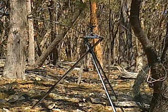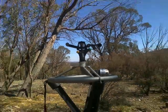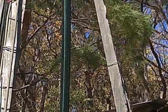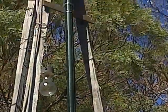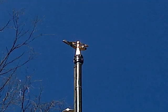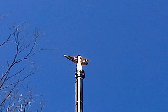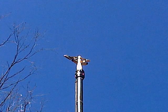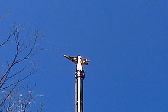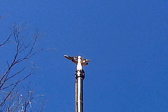And therefore, instead of coming home with a 20 millimetre Mark II Model S, what I came home with was a 25 millimeter or 1 inch Toro Monsoon, which has 5.6 instead of 4.9 millimeter main jet, and I think 4.2 instead of 3.9 for the smaller jet.